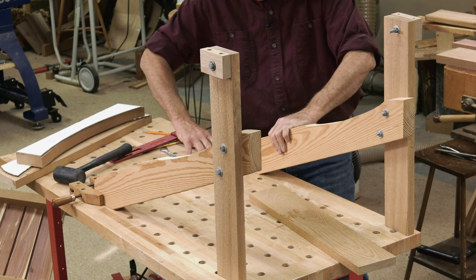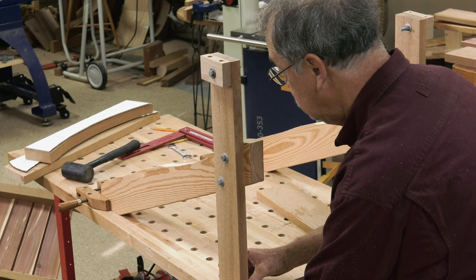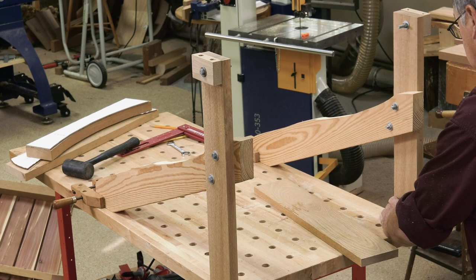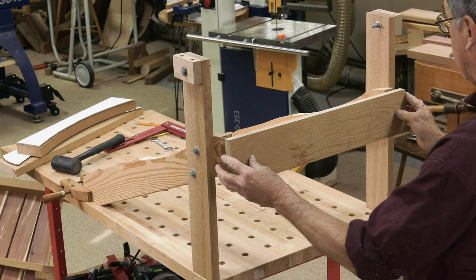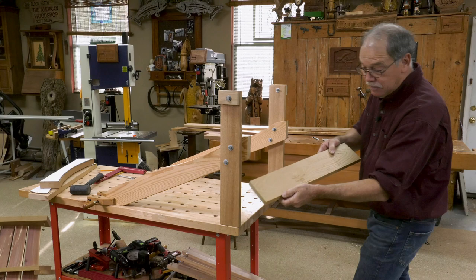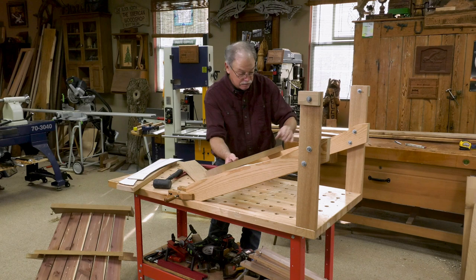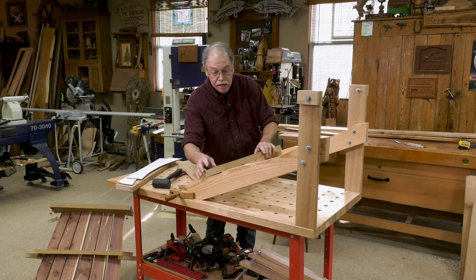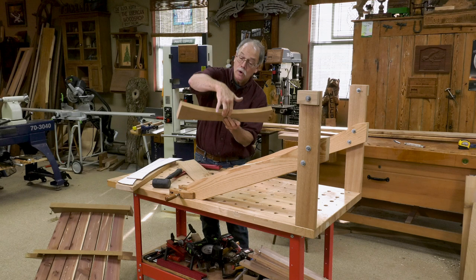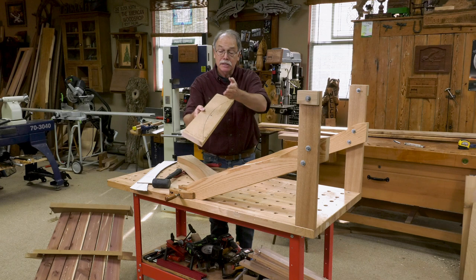Note the orientation of the longer southern yellow pine board — I've already assembled this one on the other side. I'm coming around to the front. You'll see how this needs to be oriented just to the edge. I'm using the bench as a jig, siding down the legs. Then I'm bringing up the front rail that goes flush here and here — and that needs a graceful curve, which I have templates for and will cut on the bandsaw. I need a back rail too that will accept the back pieces of the Adirondack chair. The middle rail has to be cut at a 27-degree bevel cut — the third of three bandsaw cuts.